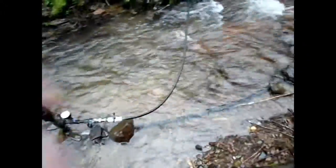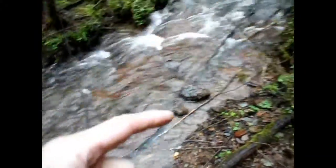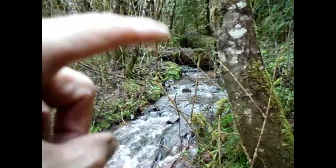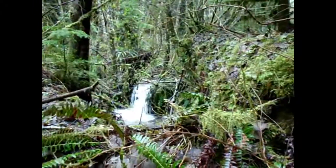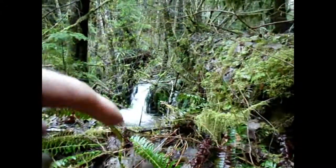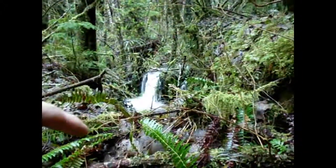Here's my newest ram pump location. As you can see, we're about as deep and thick into the shit as you can get. I've got a one-inch piece of poly. A lot of people say you can't use poly, got to have hard pipe — that's bullshit, poly works just fine. I've got about a 50-foot piece that runs up underneath this log right here. The head has a good two, three-foot drop. The water down there where the splash is going is about four feet deep — it's a pretty deep hole.